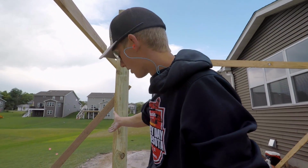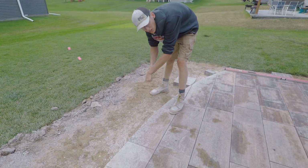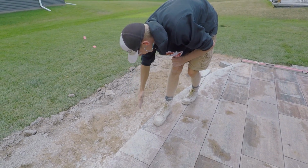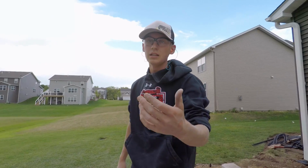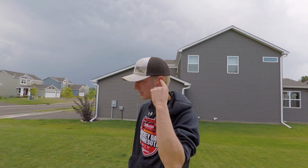We've got an outside radius cut over here. The outside radiuses are a lot easier to cut than an inside radius because when I run the saw along here, I can work my way back and forth doing cuts like this, cutting deeper into the radius. And every time I go back and forth, I can take the back of the saw and run it into the cutoff block. That's junk anyways. So outside radiuses are easy. Insides are always a little bit more tricky. So plan that into your project and estimating of time and things like that when you have an inside radius. Also, eye protection, ear protection, always when doing this type of stuff.